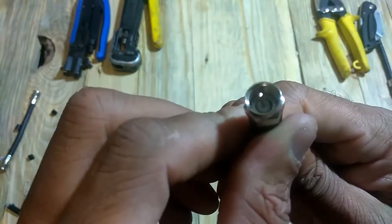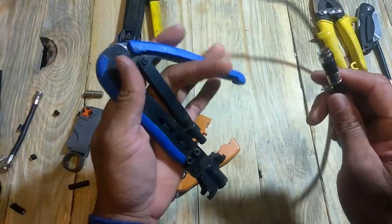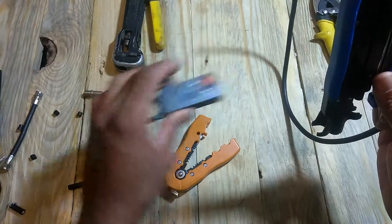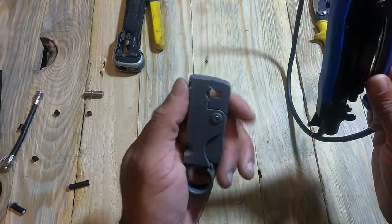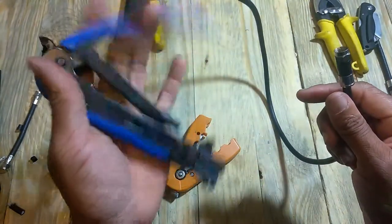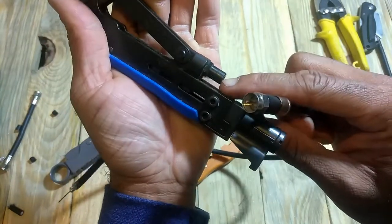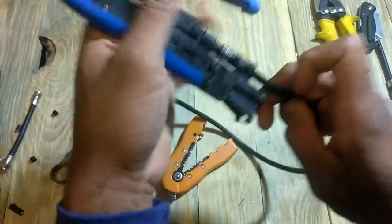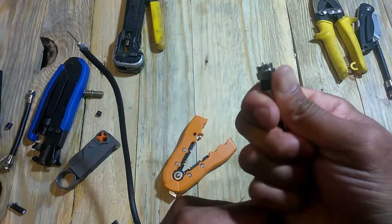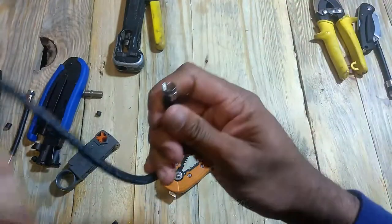We have our compression tools here. This one is a compression tool — I'll put a link to these compression tools in the description. I also put an Amazon link for a compression tool. This one had to be adjusted, so I had to calibrate it. For the compression tool, you go in at an angle and stick your stinger in the hole in there, then you just compress it — that's going to give you a watertight seal. And as you can see, you can't pull that down. You could probably hang 200 pounds off of that — you could probably string yourself up and hang from this one connector.